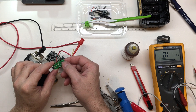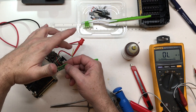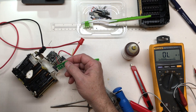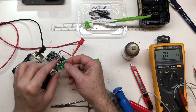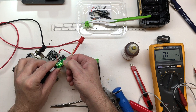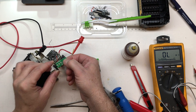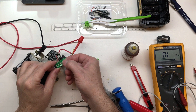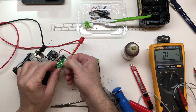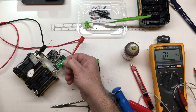To test this board — since we have a cell out, there's no voltage across red and black — I have about 21 volts coming off my power supply hooked to it. There we go — already 18 volts. At 16 volts it gets us one LED lit. It goes out at 15 volts, so right at 15 and a half volts we start getting our first LED.